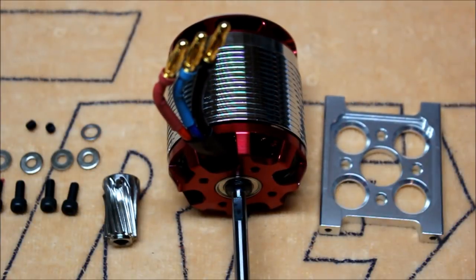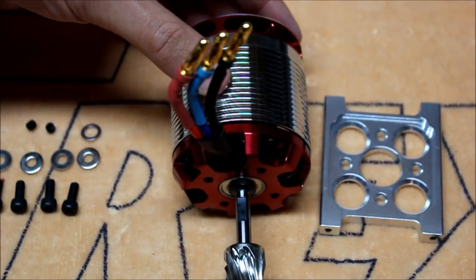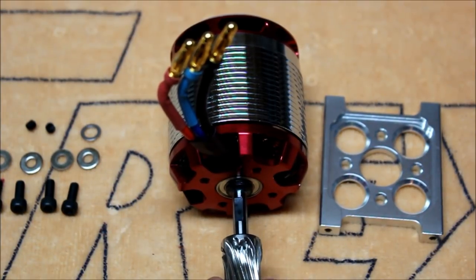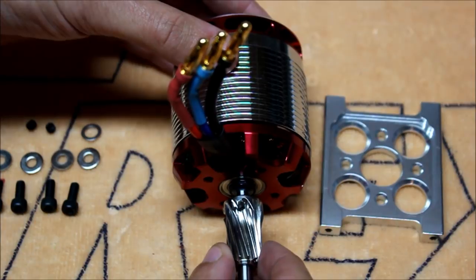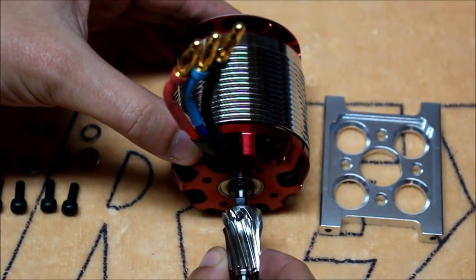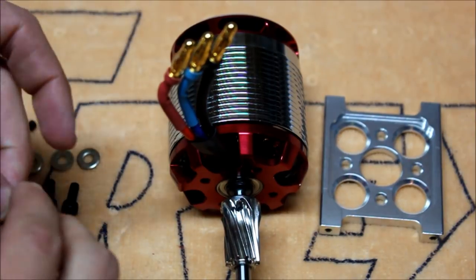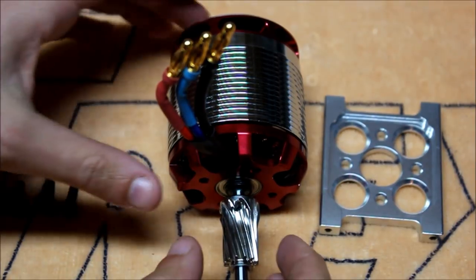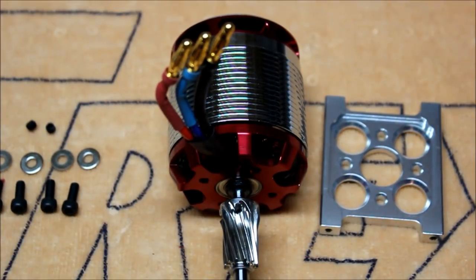Now we're ready to install the motor onto the motor mount and then install our steel pinion onto the motor shaft. To fasten this pinion, slide it over the motor shaft and take note of where the machined flat spot is — that's where one of the set screws is going to bite to hold the pinion from rotating. The flat spot is quite long, which allows you to adjust the height of the pinion. Apply some red Loctite to the set screw but don't tighten it down fully — just until it touches the flat spot so you still have some pinion adjustment. There's one washer that's different from the rest with a larger inner diameter that slides over your motor shaft to space your pinion up slightly from the support bearing. Once installed, pull down on the pinion very gently until it touches that bearing, then tighten the set screw.